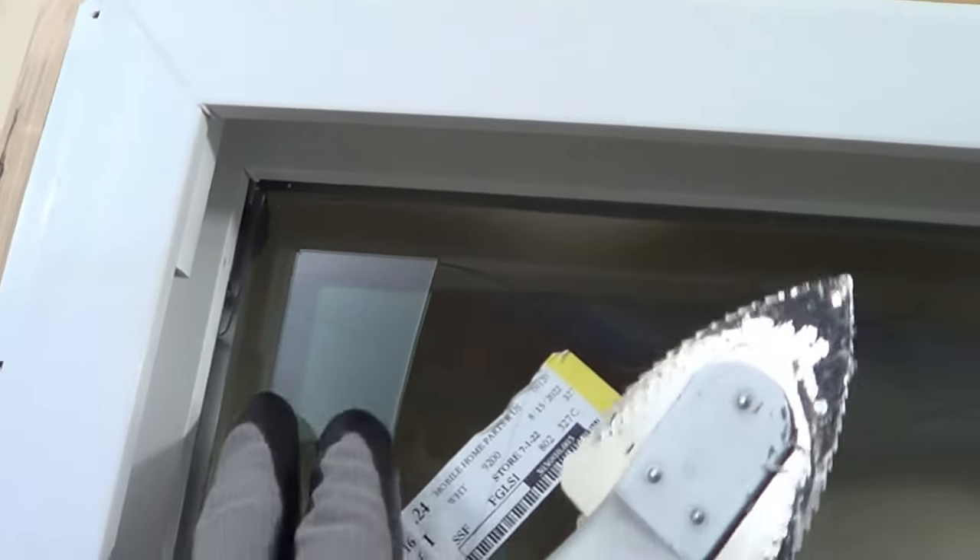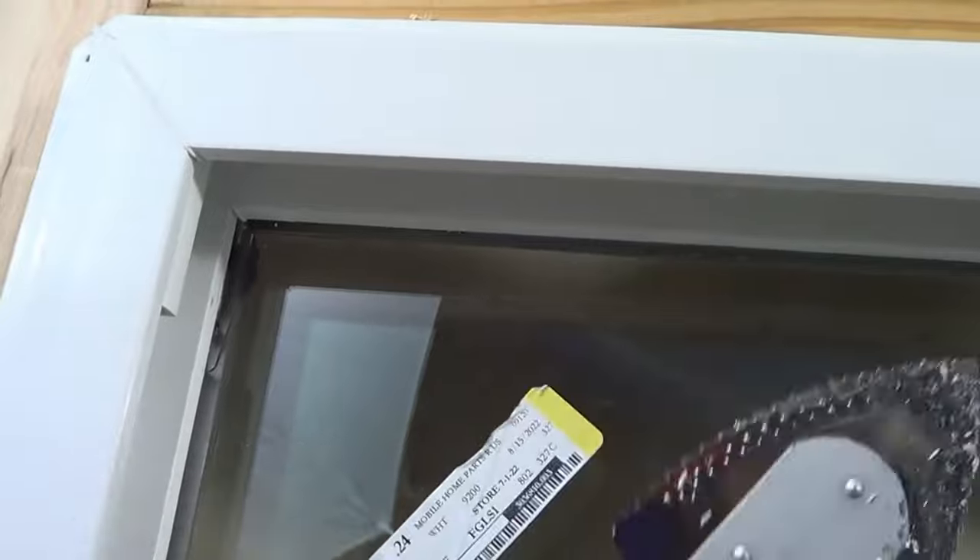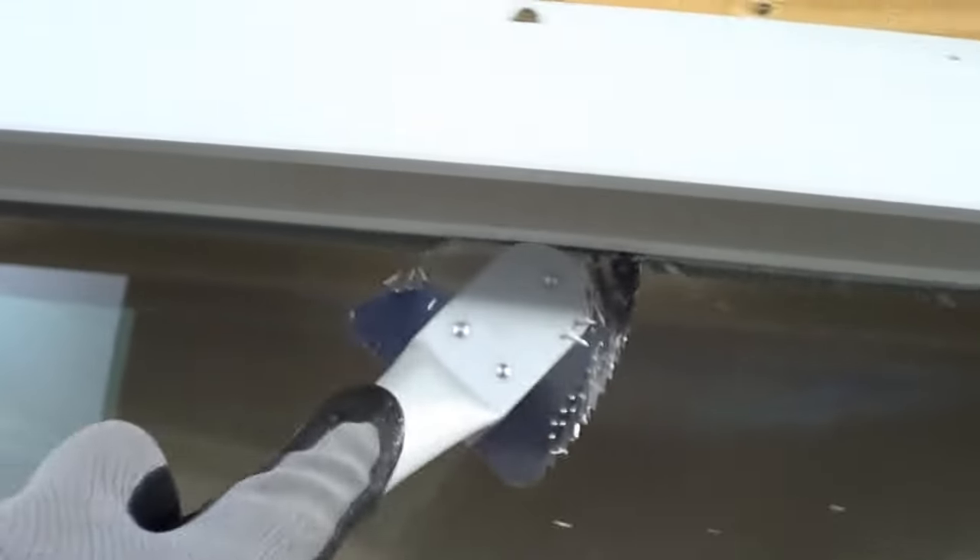Now we've gone inside, and we're going to be concentrating on the seal between the pane and the frame of the window. We need to break that, and that's where we're going to use our window glazing tool. This is also where you can use that vibrating tool, but you want to be real careful that you don't mar up the edge of the vinyl on the window — sometimes that's a little bit of overkill for this application. One thing to note: once you break this seal, the window pane is going to fall out. So you might want to think about going outside and taping the pane to the frame of the window. Then once you've gotten the seal all the way broken, go outside and let it go and take it out that way. Those edges are razor sharp, so be real careful. We're going to concentrate on getting this seal all broken out.